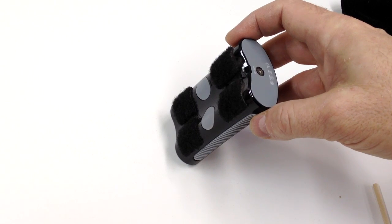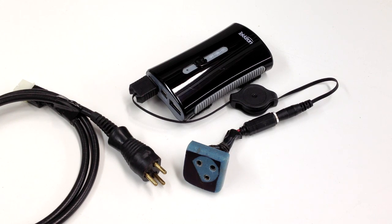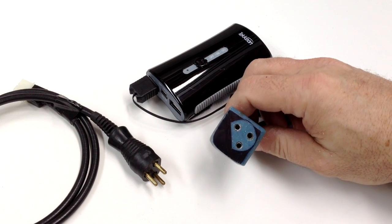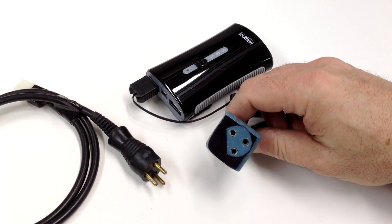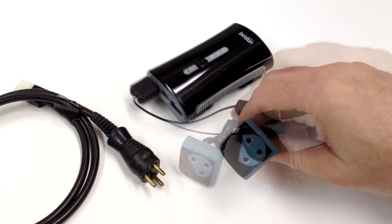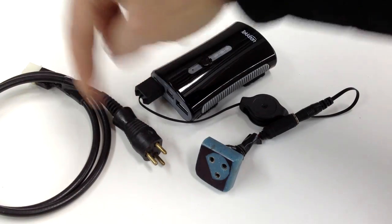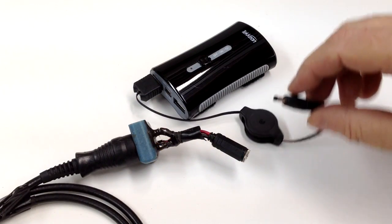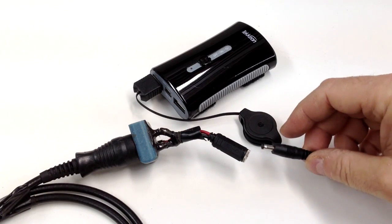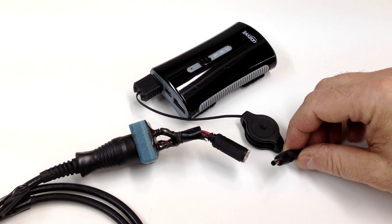I've mounted a couple of squares of Velcro onto the underside of the battery pack to attach it to the helmet. When I first started testing this battery with the 3M helmets, I wanted to create an adapter that would let me plug the power cord from the helmet directly into the battery pack. So I made a little adapter that mimics the plug on the 3M battery — I took a couple of pieces of brass tubing, glued them into a piece of Corian, and wired the leads together. There are only two leads that need to be wired, and although there are three prongs on the cable, there are actually only two wires. This was a good proof of concept for using a 1.3mm female plug to connect to the 1.3mm male portion of the power cable.